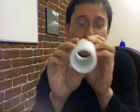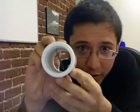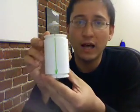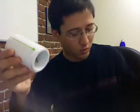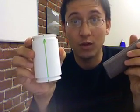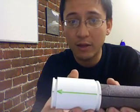The pipe insulation cutter is mostly just a captive normal X-Acto blade in there, held together by a couple of pieces of PVC. There's a useful guide on one end to show you which way to insert your pipe insulation. And so what you're going to want to do is just find the seam on your pipe insulation. It's not actually split, but it's partially split right there already. And line that up with the guide, arrows pointing in the direction you want to be pulling. So we're going to just line up with the guide like that.